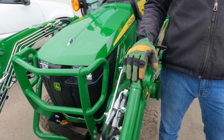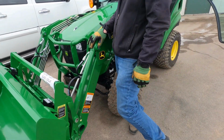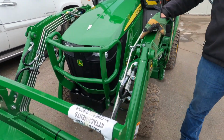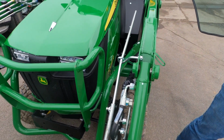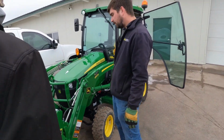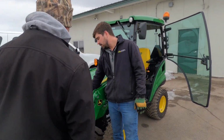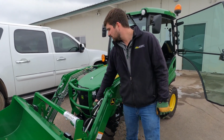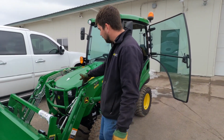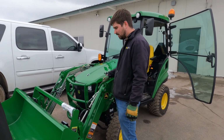It should be right now. To be completely honest with you, it looks like it's off. So I might have a guy look at that for you. But that crevice should tell you that your bucket's level, essentially. I suppose you could just level it out on the ground and then set this set screw. It's just a set screw. They should have looked through that. When it's level, you should have this right in the notch there. That's what's telling you.